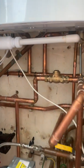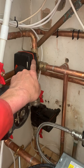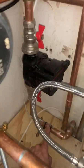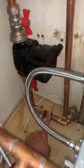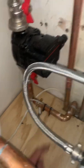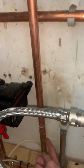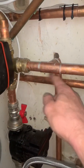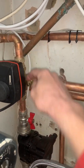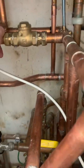So basically we've got a flow of the system coming in, and a flow into the mixer, and then we have a flow temperature sensor after the mixer, so that's reading what the temperature is of the water. And then using the return from the manifold up here, it's circulating in a loop, and whenever it draws in some flow, it pushes out the return back to the boiler.